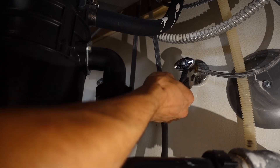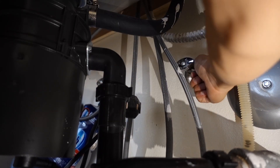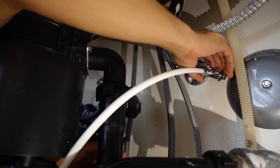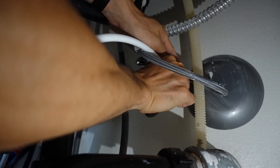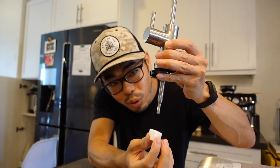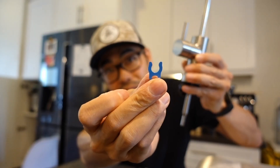Now I'm going to turn off the cold water supply and attach this thing. We're now going to install the faucet — it's really straightforward. You drop it into the hole, then you have this black washer that goes underneath, and then this nut holds it into place. After that, you put in this quick connect, and this blue lock will be in as well.